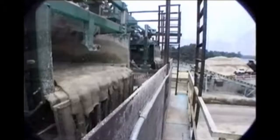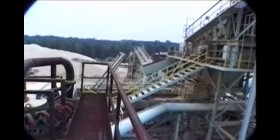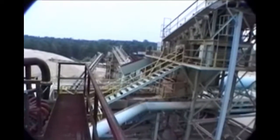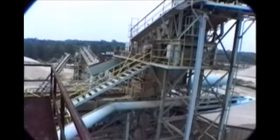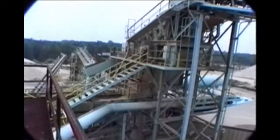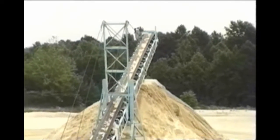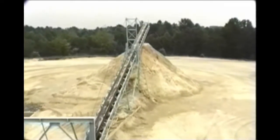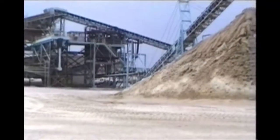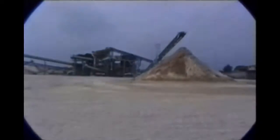Prior to the installation of the Derrick units, a pair of slope plate clarifiers were used to concentrate all solids reporting to the settling pond. The solids were then mucked from the pond on a daily basis and hauled off to a nearby land farming operation. The Derrick customer is more than pleased with his ability to turn a former waste product into cash. The clarifiers are visible in the lower right hand portion of the screen. Besides the new cash flow, he has also realized other operational savings. He still uses the clarifiers to recover the ultrafine solids not recovered by the Hi-G dryer system, but at greatly reduced costs. Polymer consumption has been cut in half and the plugging of solids between the slope plates in his clarifier has been greatly reduced.